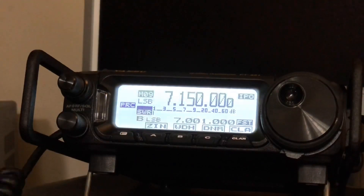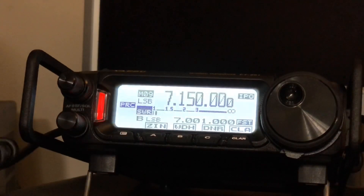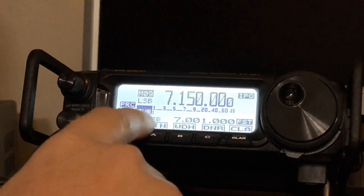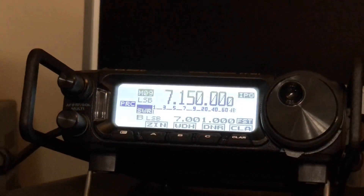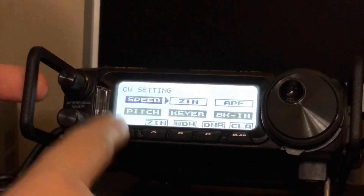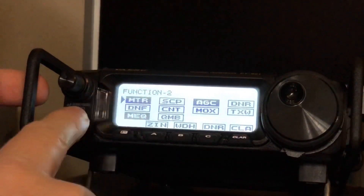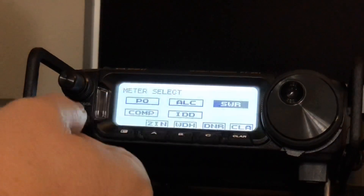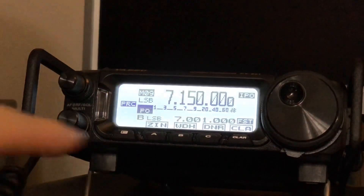So if you're not sure you're getting output, notice right here it says SWR — barely moving. I'm transmitting into a dummy load. I leave my metering on SWR just so I can quickly catch if I've got a situation going on with a high SWR. Now I'm going to go into the function menu and tap it until I see MTR for meter. I'm going to press that to turn it off and press it again to make a selection. I'm going to move it over to power out — PO. Now see it says PO.